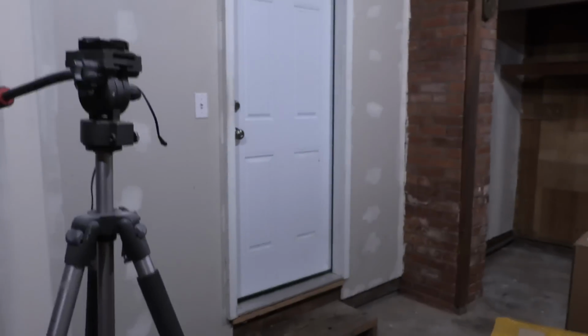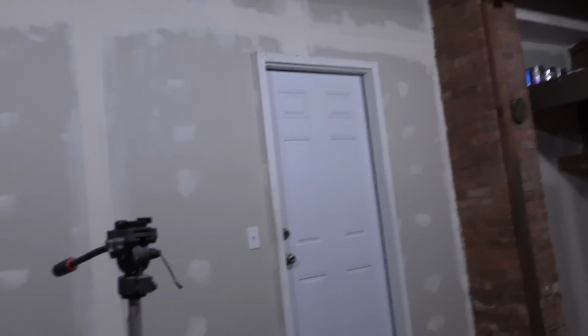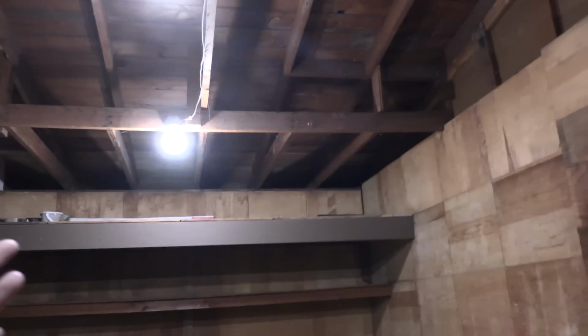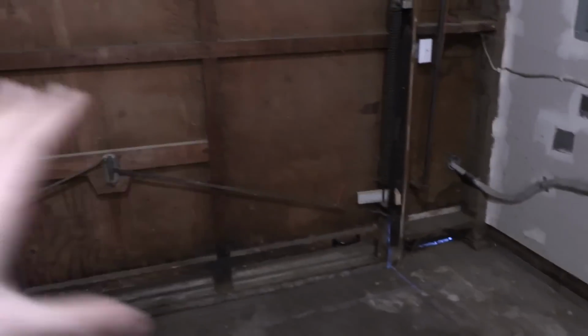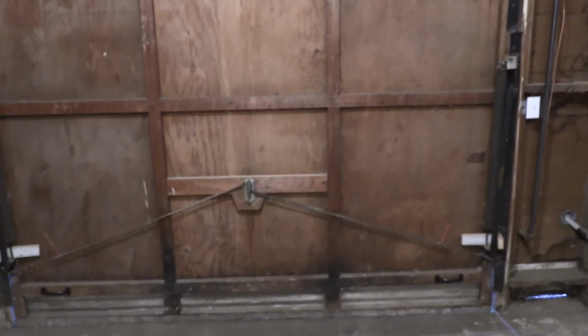I don't know if we'll find space for all these fans. The other thing is we want to have a lot more CFM coming in than we have pulling out. So we have a high pressure system, and the way we'll be able to test that is when we open that door right there to the house with all the fans running, it should blow air in the door. Meaning the ventilation system won't be sucking in stuff from everywhere outside and from inside the house, dust and debris from everywhere else. It'll be a high pressure system pushing all the air out. So if a dust particle flies through that vent on the inlet, it should get pushed to the outside of the shop or brought out through the ventilation. It shouldn't get sucked in towards any of the fan system.